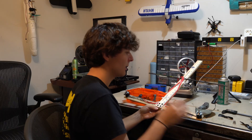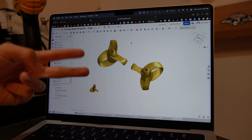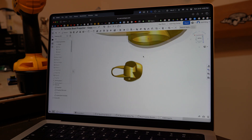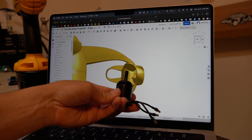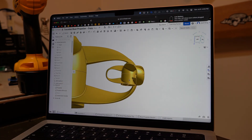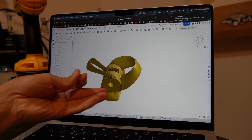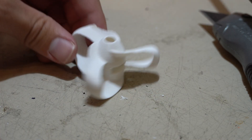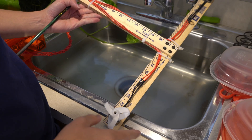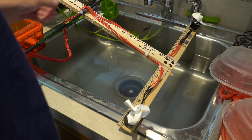This is RC TestFlight's toroidal propeller from his latest video. What I've done is scaled it down to fit this motor. One problem was the shaft is smaller than the propeller, so it wouldn't be long enough to bolt on. I cut out a hole for a nut to insert here, and then the propeller screws right onto the motor. Let's go print this thing. They look really good. I printed the toroidal props and also some regular props. We're gonna compare the two — that's definitely less thrust than the toroidal propeller. That's crazy.